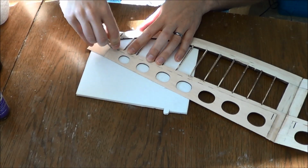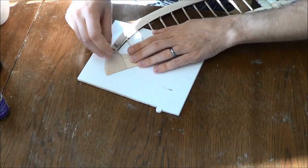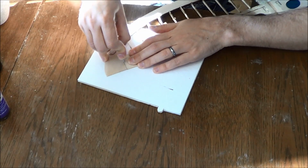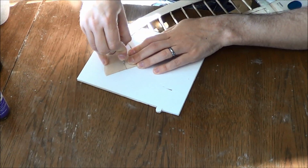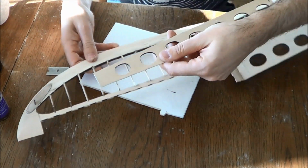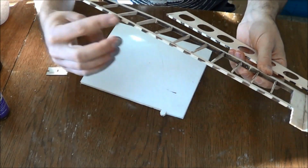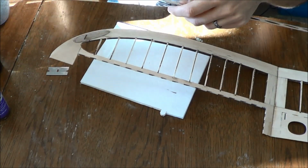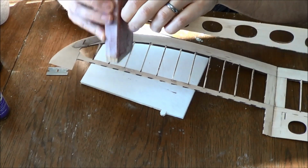And now you're going to stop right here at that joint, because what we're going to do is actually cut this glue joint. Now, that pops your flaperon loose, and we'll want to sand this edge a little bit just to smooth it out. The other thing is we're going to want to remove some material off both ends of our flaperon so that it has adequate clearance for full travel.